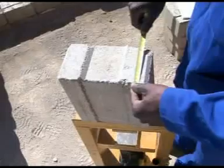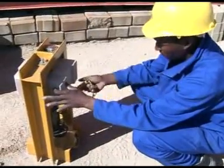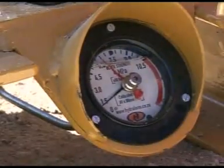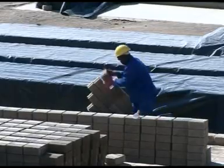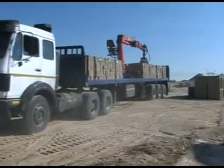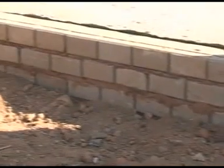Random tests can be conducted using a Hydroform block tester. After 28 days, the blocks would have almost gained their full strength. Sample blocks are tested and the results recorded. 5% cement gives a 4 MPA block, whilst 8% cement gives a 7 MPA block. After 14 to 21 days, the blocks are ready for construction or transportation to the building site. Your mobile Hydroform machine can then be moved to its next job site. Hydroform blocks can be used in foundation brickwork as well as superstructure.